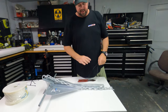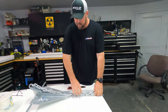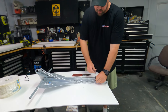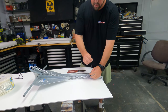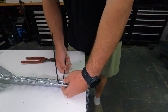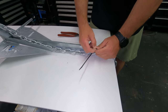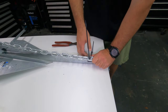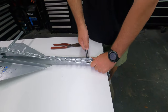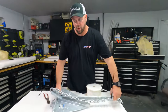When you pull on this anchor from underneath the water, it's gonna pop these zip ties and pull it straight up. It's called a quick release anchor. 90% of the time you'll get your anchor back this way. There will be a few times where the anchor is wedged between some culverts, but this will get it out most of the time. If you have it rigged the other way — straight off the back of the shank — you will never get it back. Also, don't use Harbor Freight zip ties — get a good quality one, it makes a difference.